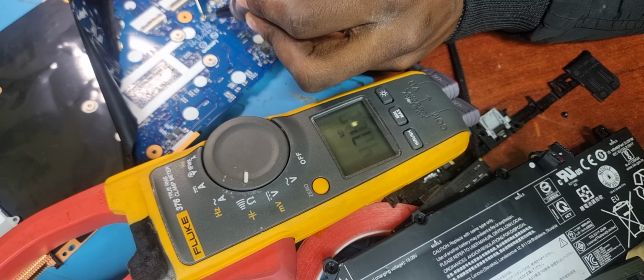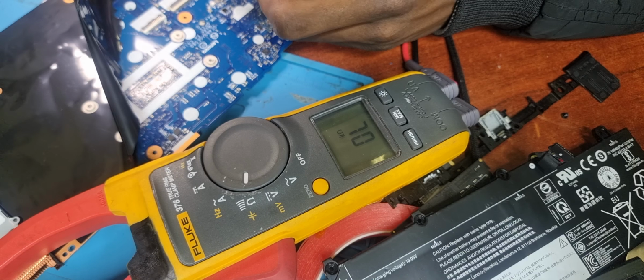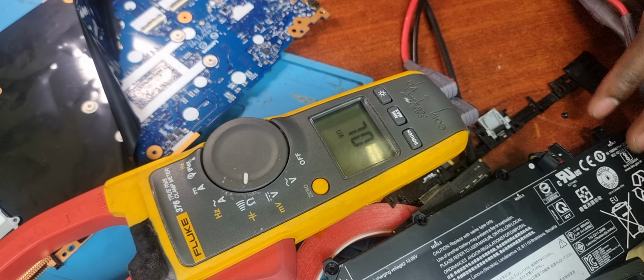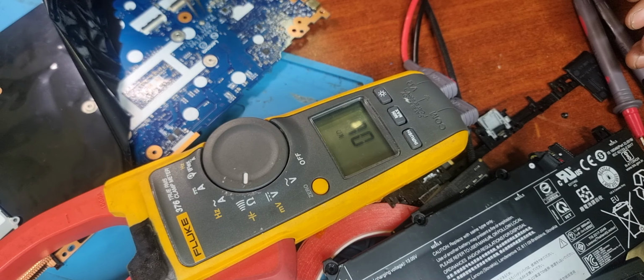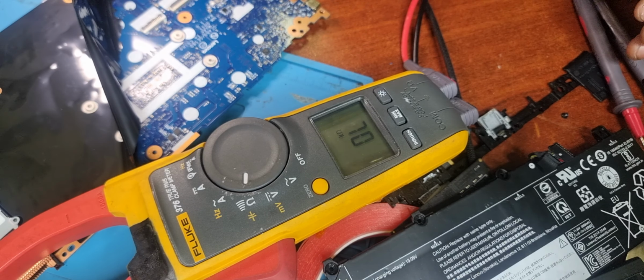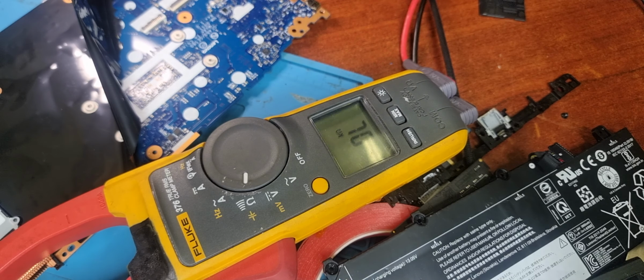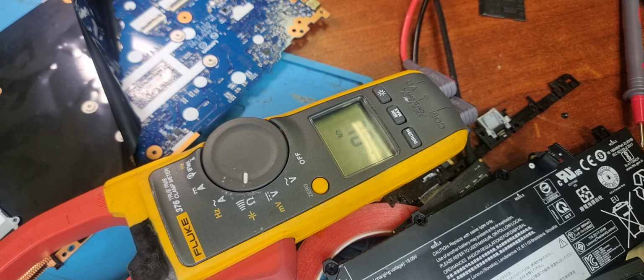46 kilo ohms. Yeah, the MOSFET is fine. You measure the second one, the first one actually, there, 45. So those MOSFETs are fine. And they are definitely okay. But for some reason, they do not generate that voltage you want. Let me grab a donor board and steal two MOSFETs from there. Check, I don't know. Whatever you want to consider.